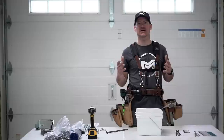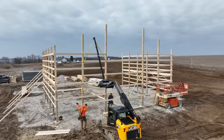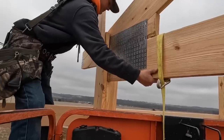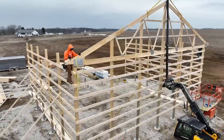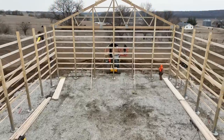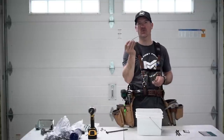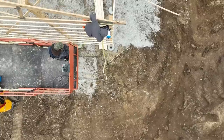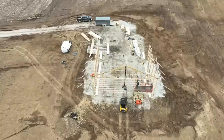Now, how we attach our trusses to the frame. We use columns spaced eight feet on center, remove the center ply, and set the truss inside that center ply — inside the building. On the two outside edges, trusses get face nailed. Our first truss is an end truss, and it gets face nailed into all of the columns. Those columns run from the footing all the way up to the top chord of the truss for strength all the way up. We use four-and-a-half-inch ring shank hot-dipped galvanized nails wherever the truss intersects the column.